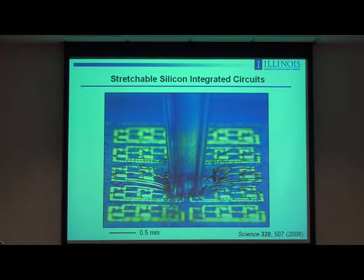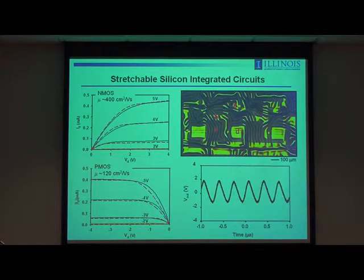In this kind of geometry, you can stretch it in multiple directions, and the wrinkles unspool in response to the applied strain in a way that avoids damage to the circuit. A glass pipette plunged into the center of one of these things illustrates the physics nicely: you can see the wavy structure pulled out where the circuit is accommodating tensile strains, while other lines still retain wrinkles. The circuit really is soft in a mechanical sense, beginning to approach that vision for skin-like electronics. However, there's a limited range of stretchability — if you continue to deform it, there's no more wave structure to unspool and eventually the line would crack.